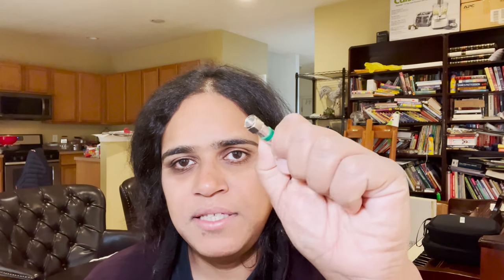Next, we're going to talk about why you find the F-connector in amateur radio stations. If you have internet access in the United States and other countries, you probably have it through coaxial cable — unless you're lucky enough to have fiber, or you have DSL, or satellite. You probably have some interaction with the cable company. In high-end or even low-end amateur radio stations, you'll find a lot of people using F-connectors in some part of the station — and it does have a legitimate purpose.